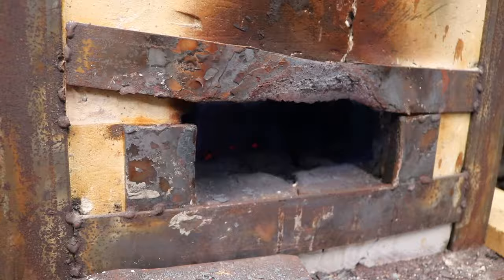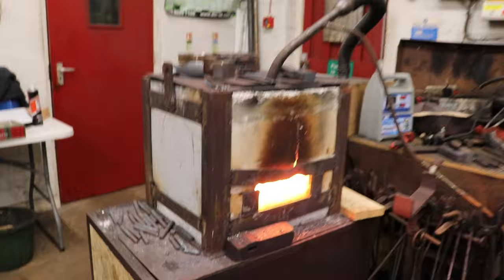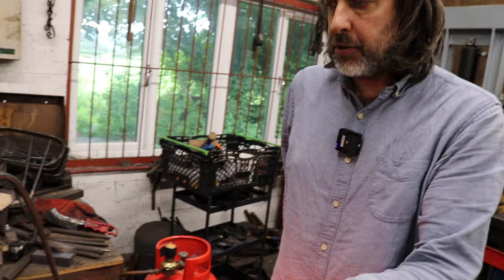So Nick, how are we looking with the forge? Is that at the right temperature, you feel? Yeah, we're looking at a yellow there, which is what we need. If it looks orange, I'm not going to get through the whole thing in one heat, and I want to do these start to finish in a single heat. What I'll do now, because it's important to limit the amount of scale, is put a blank in